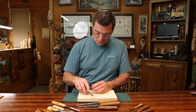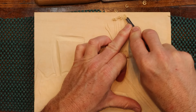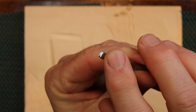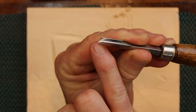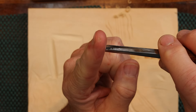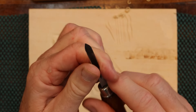The next one is a little larger V-tool — a quarter-inch V — and it's just good for relief carving and character carving. Now some people will take the V-tool and put the wings back so the tip can get into tighter corners. You can do that. Some tools come very flat in the front with no angle to them whatsoever, but that's going to be up to the individual carver's preference. I have them both ways, so that's another thing to think about.